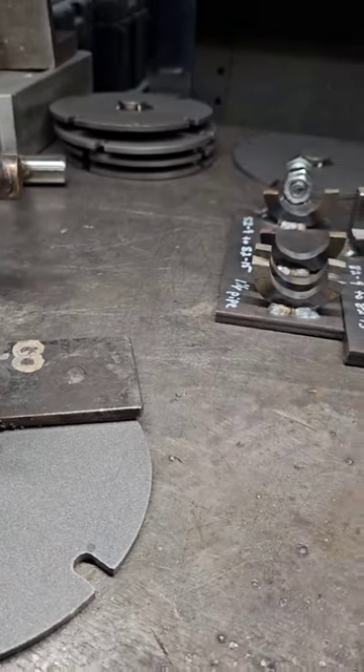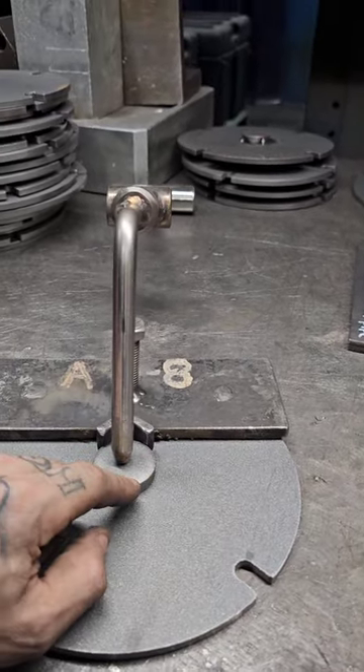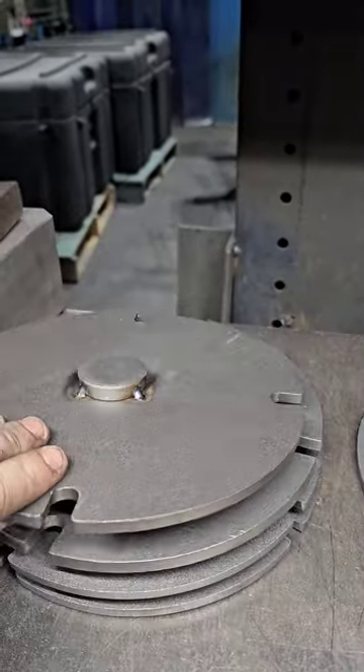This sits against it, and I highly recommend getting a finger clamp — it helps keep everything in place so when you tack it, there's enough weight on it to hold it down so the parts don't pull up.